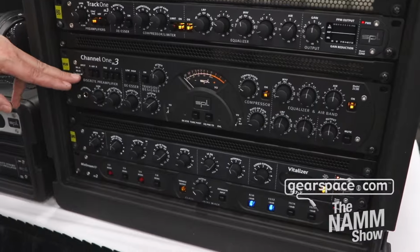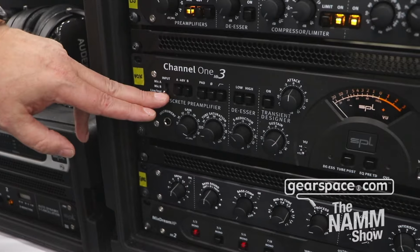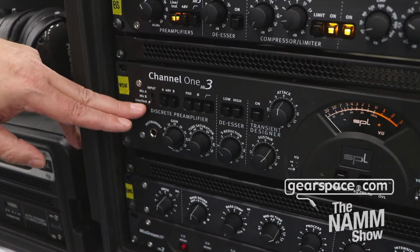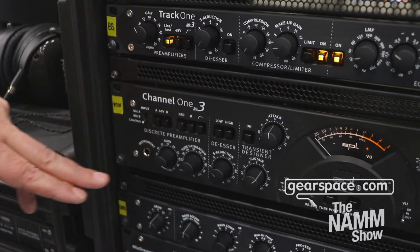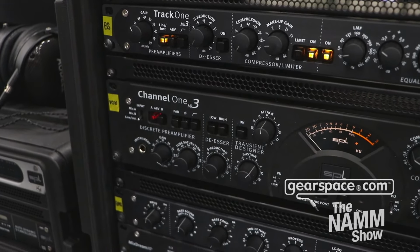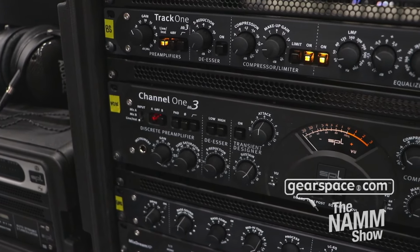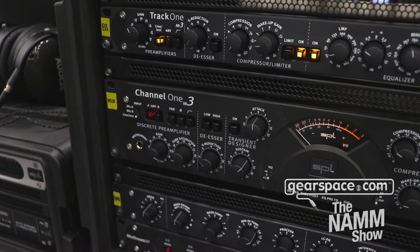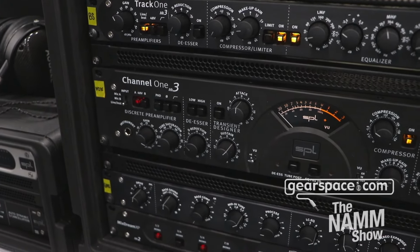One feature that is really interesting, but only very small on the front panel, is that input switch. It allows you to compare two different microphones and a line signal that might have another microphone on, with individual phantom power switches. You can compare microphones through the same audio processing channel and the same microphone preamplifier. As we all know, this has always been difficult if you don't have the same preamp to judge what the microphone is doing. Now this is possible, and it helps you to select the better microphone for your recording.